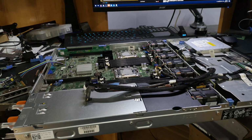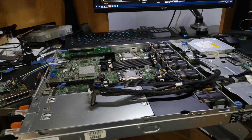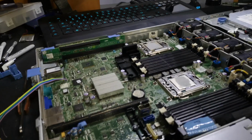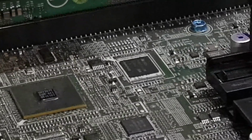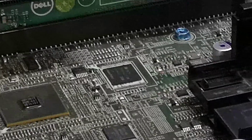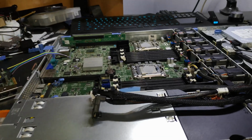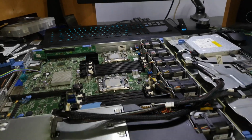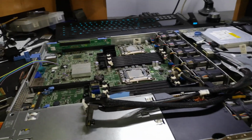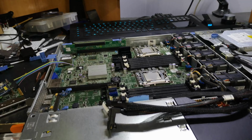Yeah, I mean, the eMMC thing, if it's just a memory chip, if it's just storage, then maybe the theory is that flash memory has a limited amount of write cycles, and maybe Dell's firmware update process just writes loads of crap to that and just burns it out as it's upgrading. There are 2 images, I think, flashed to it, so there's like a backup version or something, so maybe that contributes to it. So I'm going to try and find one of those chips, order it, and then hopefully I can actually figure out how to, or at least confirm if that is how it will work.